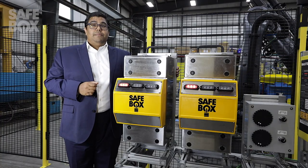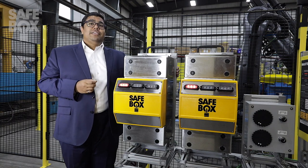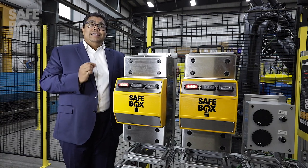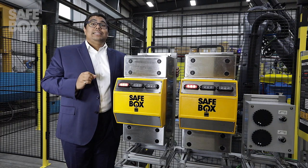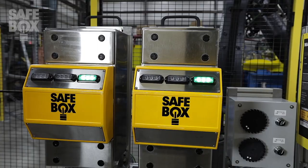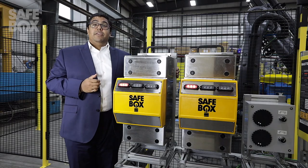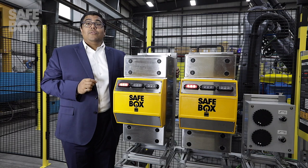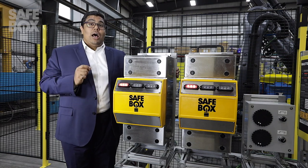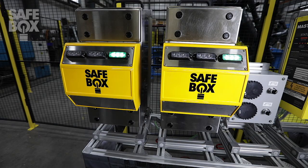The second part of our system are the field isolation devices. Similar to your conventional disconnects and isolation valves, these devices are responsible for the mechanical and physical isolation of hazards of energy. These units can support pneumatic, hydraulic, and electrical systems. These plug-and-play devices are integrated in the field downstream from the motor and enclosed in ruggedized material to ensure optimal performance, even in harsh conditions. With built-in intelligence, these units will ensure all information relates back to the master to validate its functionality.